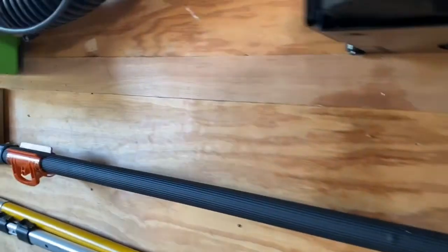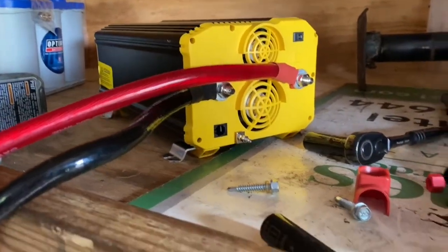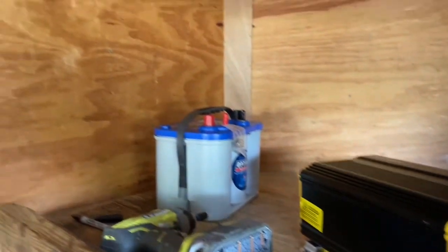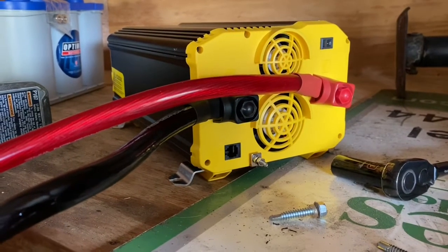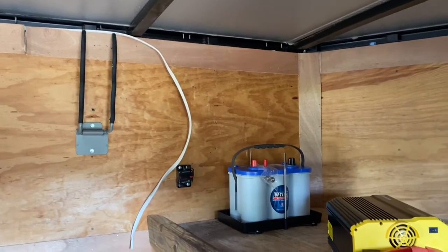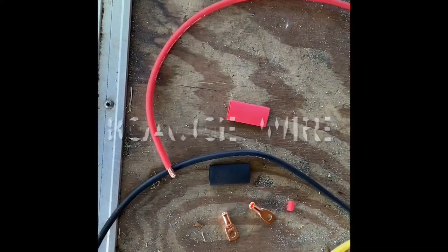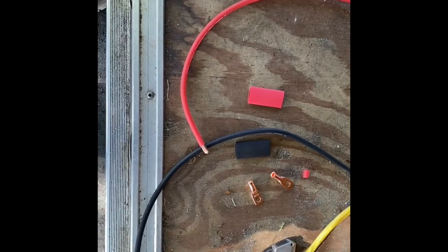He has lawn equipment in this trailer, and up here we're going to install a switch for the lights. This is the inverter — these heavy wires you see come with the inverter. He brought a marine battery, which I asked him to do, and I think that's a smart way to go. Make sure you put those caps on and get everything tightened up on your inverter. Start locating every place you want to put everything. We mounted the battery, screwed it down to the plywood, and it has tie-downs to keep the battery from moving. I had to custom-make the lengths of these wires so that everything would work properly — this is a long process but it worked out nicely.